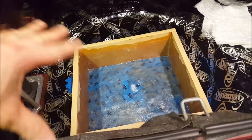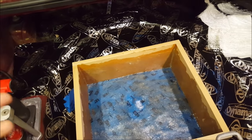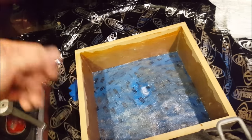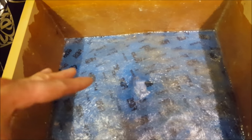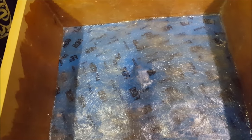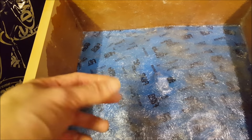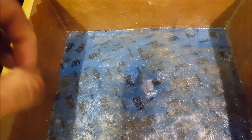A couple of tips: if your box moves around, I'd recommend securing it somehow — maybe use duct tape to keep it in place while you're dabbing, since the tank is directly underneath so don't use screws. This is about one and a half layers — some areas are two, some are just one. I want to put one thin layer on and cover everything first, let it cure, then proceed to the next layer. Try not to make it resin-rich — if you blob the resin and it looks very smooth and glass-like, that's actually pretty brittle. You just want enough to soak into the woven mat. Make sure you have no air bubbles; if it's really white in some areas, keep dabbing to make sure it soaks through so it's well sealed and doesn't become brittle.